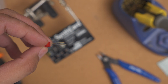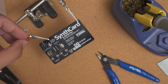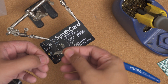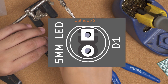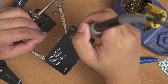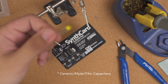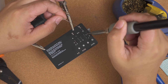The other components are a bit fiddly because you can't solder them from the top. The LEDs will only work if you install them in the correct orientation. The cathode side with the shorter lead must go into the square pad — the cathode side is also marked with a flat side on the footprint. I use tape so I can flip the board over and then solder them from the back. I do the same with the ceramic capacitors — these don't care which way you install them, and I also use tape so I can solder them from the back.